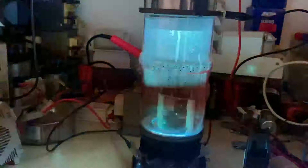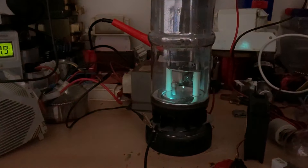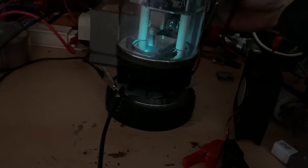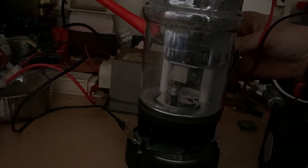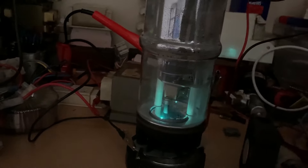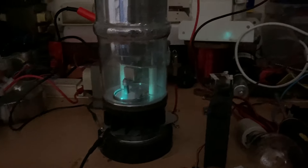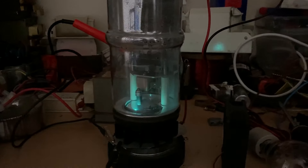Let's take it down to about half. That reading is on the AC side because this meter only works with AC. You can smell the heat — it's getting a bit warm now, but that's to be expected. Let's really strike it — that's a short circuit and then as we lift it — there we go, that's why it's normally a bit of a pain to strike. It's been on for well over 24 hours now in total to bed it in, since it's basically brand new.